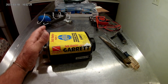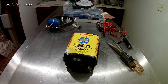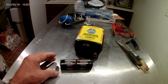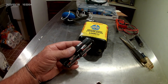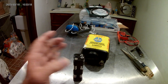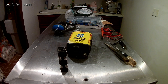This is the main controller guts box — it's got all the different dials and everything. This one was given to me by a friend who had it for quite a few years. It was sitting for about four or five years in his closet with the battery pack inside, and the battery corroded. This is a new battery pack. I actually have one of these exact units that's in working order — this is the battery pack out of it. It takes eight AA cells which makes it 12 volts. What happened is the contact points corroded away and made it so it didn't work, and it also created some problems inside the battery compartment which I'll show you in just a second.